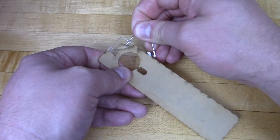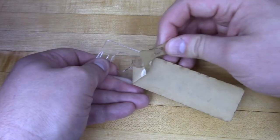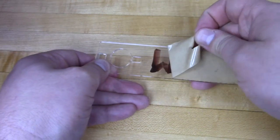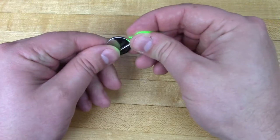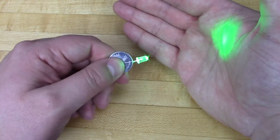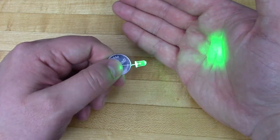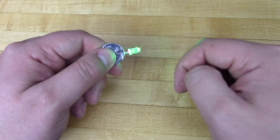Next, use your safety pin to peel away the backing of your piece of acrylic. Connect your LED to the battery — remember, the long leg is positive and will go on the positive side of the battery. Make sure your LED lights up and that everything is working just fine. Green, blue, and white LEDs tend to work best, as well as color changing LEDs.